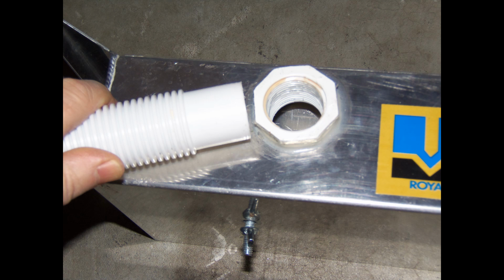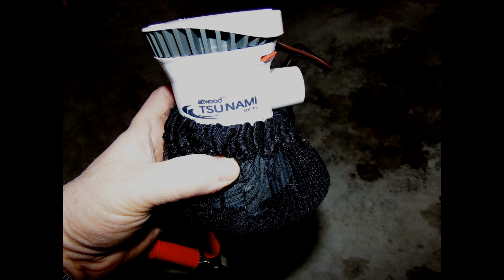The Highbanker portion uses a water flow head as shown here. It attaches to the sluice with 2 screws. Then tubing is inserted into the head and securely fits into the bilge pump end. Incidentally, this is a good bilge. It gives plenty of water to the system, but does not overtax your battery, and Atwood is a respected bilge maker. Note there is a fabric strainer which also comes with the bilge, and the bilge does disassemble if it becomes clogged.